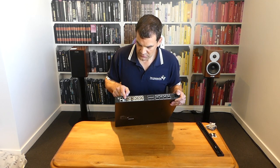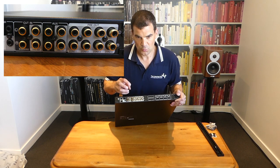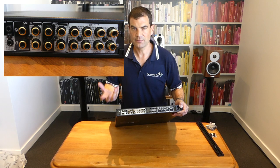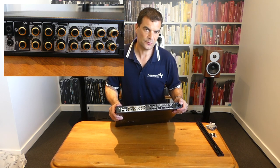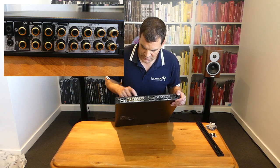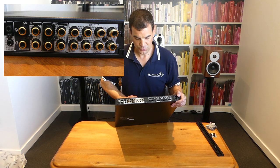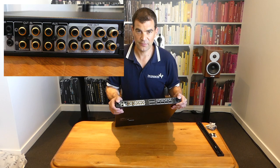You've got an input associated with products that will cut in. Now, hence the label, if it's playing, it's going to take over. So it might be a main background source or something along those lines. I guess it could potentially be utilized for an intercom or something, but look, don't quote me on that. Then you've got a couple of auxiliary inputs and outputs, and then the pre-outs associated with all of the channels. Should you choose to not use the onboard amplification, you can pre-out this to much larger amplifiers if you choose.